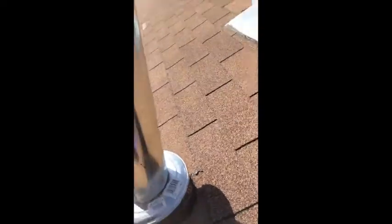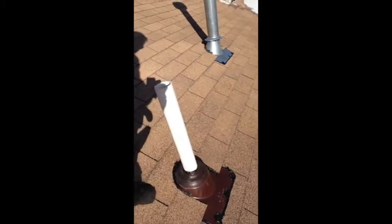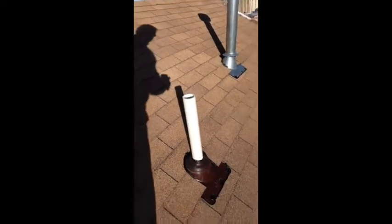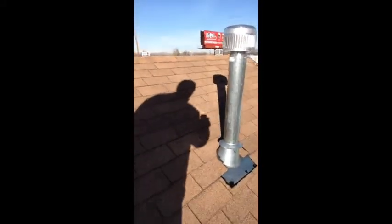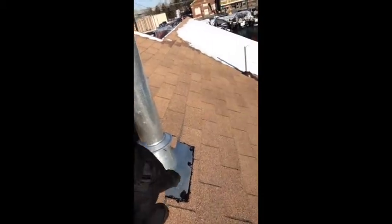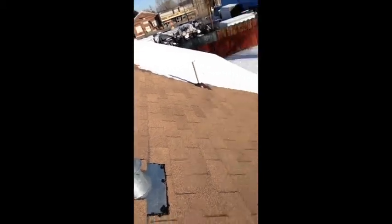You can see I tarred all the way around the complete surround here. Same with this one — tar the nails, tar the shingles to the tin, and then tar the seal just to make sure there are no leaks. This other one over here, they got the area tarred around the shingles but failed to tar the lower part, so I just got done tarring the lower part, the nail holes, as well as that lower tin.